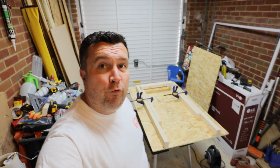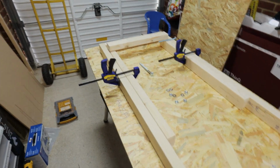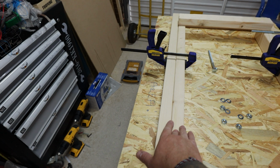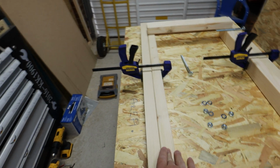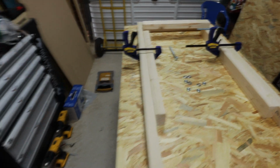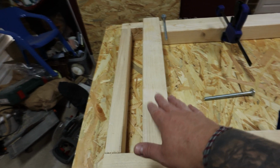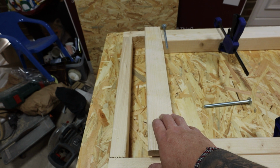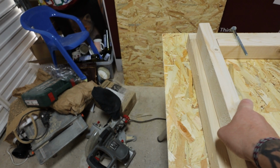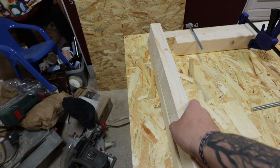So now I've got everything I needed for the bench. So what we have is we've got the outer rail that is glued and screwed from the top. We've got the leg, which is currently just being held in place by a clamp. Leg outer space. I've left this space so when it's working as a workbench, I can use clamps, okay? So I've got that whole space all the way around the 3 sides that I'll probably be working against. And then I've got the cross piece. So this allows me to have both of the legs pop out at the same time. And in theory, on April's video, it acted as a stop block. Okay, so it meant the legs wouldn't go any further forwards than that. So fingers crossed, that is what's going to work for me.